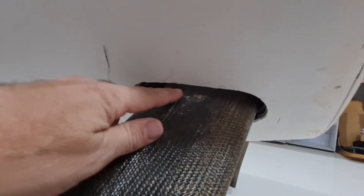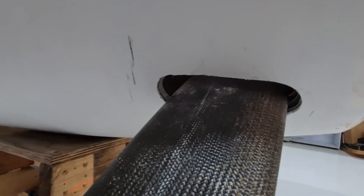When they open out you're going to have to have some clearance here to make sure that the gear leg doesn't impact the fuselage and start cracking it. So you actually want some clearance there. If you're ever going to make your own Velocity with a fixed gear, don't worry about the hole — just cut a hole. I've spent a fair few hours just trying to get these holes shaped big enough.